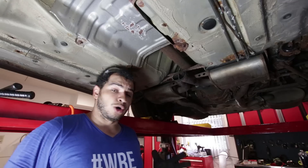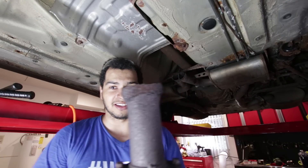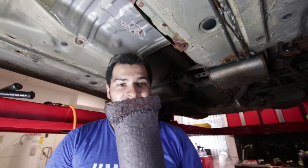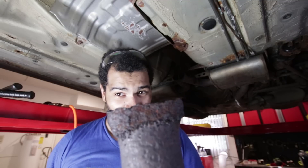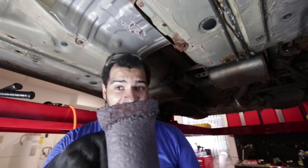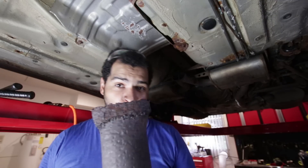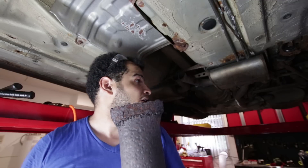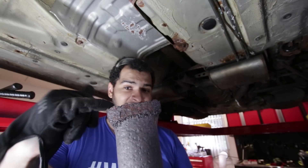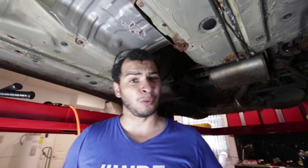So I'm stuck with a dilemma. Take a look at this — this is the rusted pipe, and as you can see, it's pretty gnarly. I don't think I can weld to that, it is really bad. So I'm going to have to find this section, and I don't know if I can do that right now, but I'm going to have to do that. I don't want to clean it up just to weld it, because you never want to weld to rust.